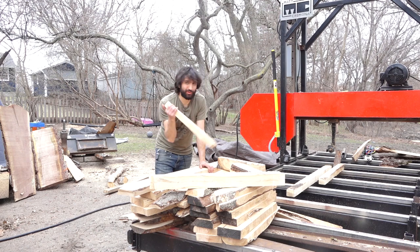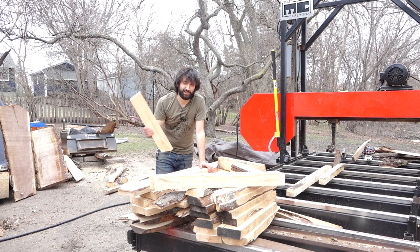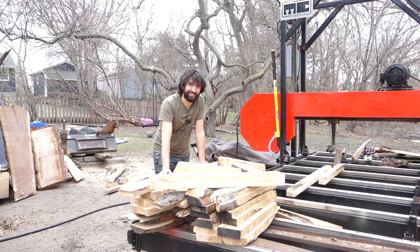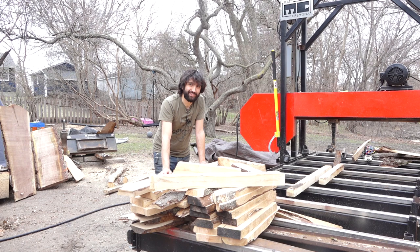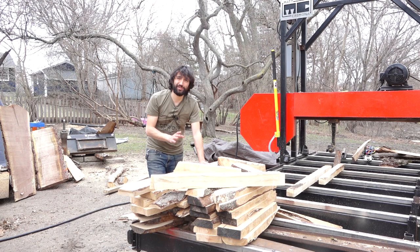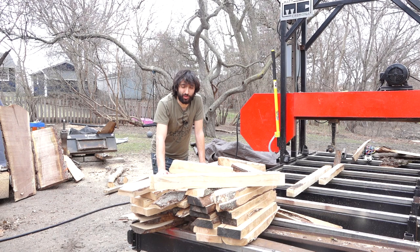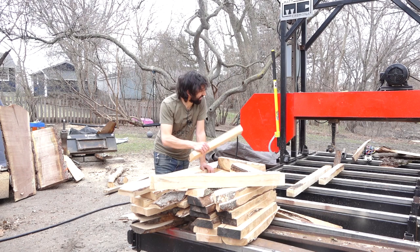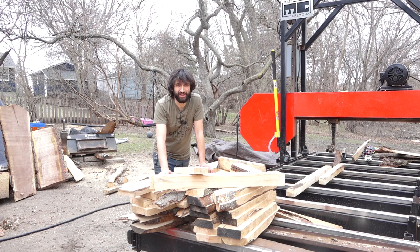One little reminder: if you do try sawing your own wood in the shop out of logs on the bandsaw, make sure you clean up the sawdust and don't leave these blocks of wood sitting on your bandsaw table. This stuff is loaded with moisture — if you leave it there and come back the next day, you'll probably have a rusty bandsaw table to deal with. I did that before. So that's going to do it for this one. Hopefully a visual representation has helped answer your questions on whether cutting a tiny little log is really worth it and if you're going to get the yield you want. Only you can decide — I can just show you what to expect. Thank you as always for watching. If you have any questions or comments on cutting tiny little logs, anything about the sawmill or anything in the shop, please feel free to leave a comment. Until next time, happy woodworking.